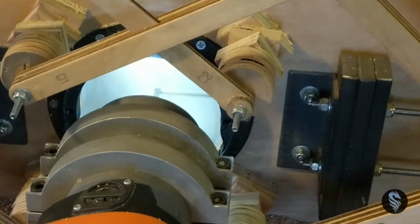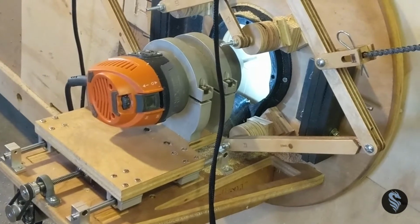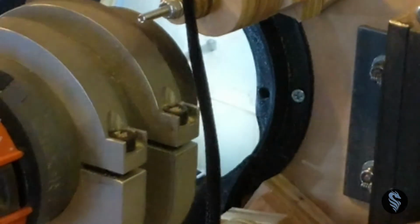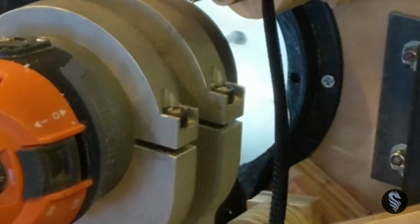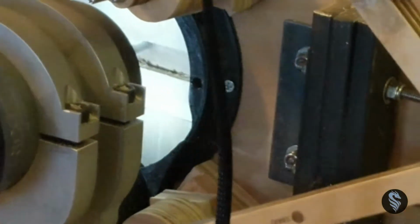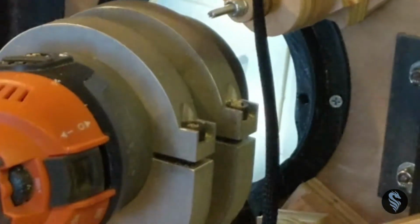The increased stability in the Z-axis is allowing the machine to cut dados more smoothly, which is awesome. And it's also allowing me to do a little bit more complex entry maneuvers into the plywood, rather than just plunging straight in. So here you can see there's a little bit of a zigzag going on until it pierces through all the way down to the spoil board. From here it's just going to open up this pocket to make the back axis hole for the whole assembly. So I'm just going to let the music play here, and we'll regroup when it's time to talk about the chain system.